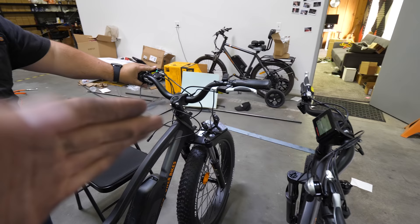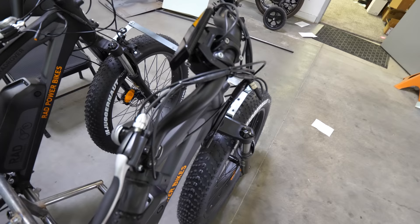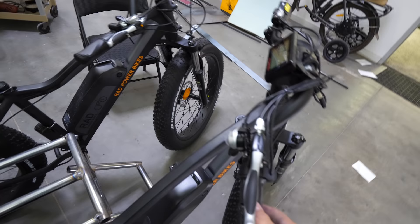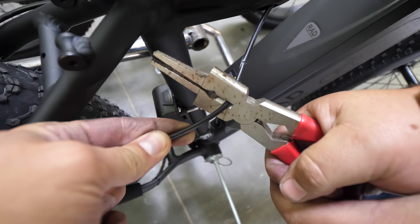The steering is normally upright, but if we take it and turn it, drop it down and rotate it backwards so it's parallel with the wheel itself, then tighten it down with these bolts, the wheel will turn when the steering wheel is parallel with the tire. With the throttle on each side she can control both motors independently while driving, and her field of view is still wide open. We're getting rid of everything we don't need on the handlebars — the bells and the gear shifter, since no one's going to be pedaling.